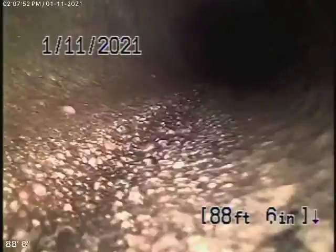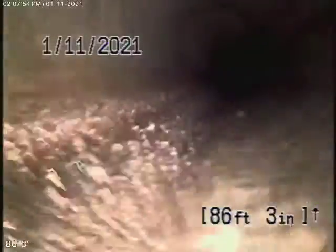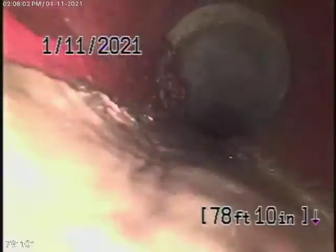We have a six-inch clay pipe over here — or it could be a concrete pipe, difficult to tell — but it's in pretty fair condition. You did see some roots in the line and those can be easily cleaned out. There's a little bit of water in the line, a very minor amount of roots. This is definitely a clay pipe over here.